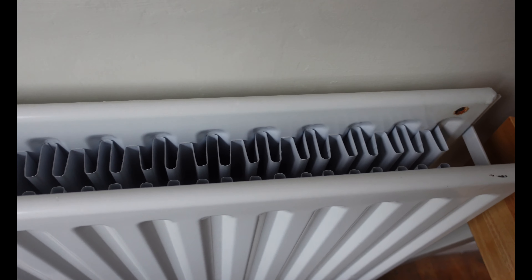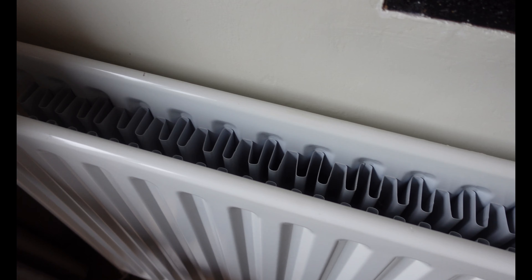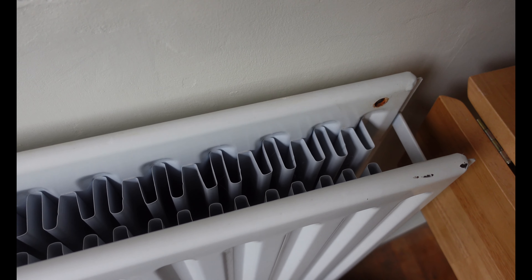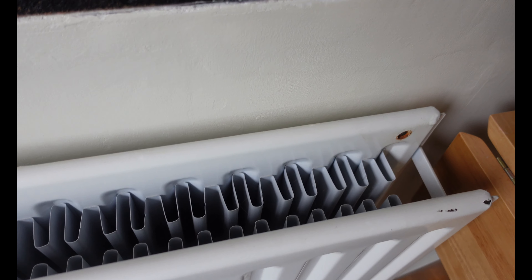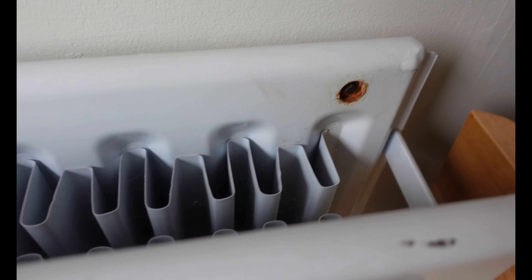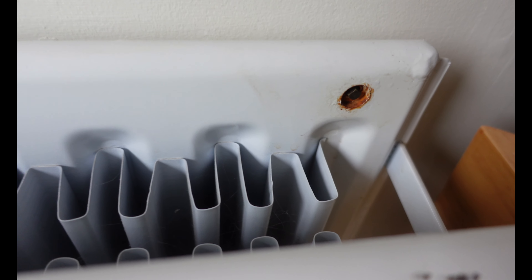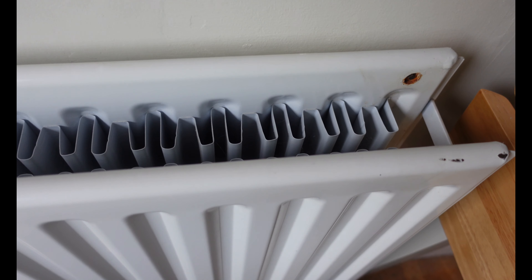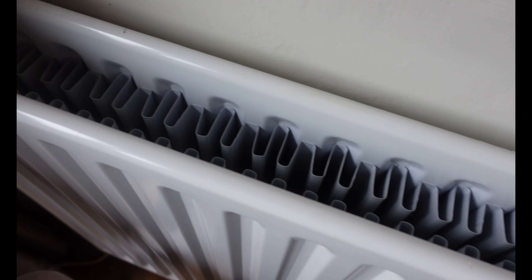So it's just a little word of advice: when buying radiators, do check where the air screw is on the radiator. Believe me, I've been to many houses where I've drained systems and found these radiators where I can't get the screw undone. I've ended up having to tell the tenant I need to put a new radiator in - and they say there's nothing wrong with the old one, and I have to say, well, kind of there is.